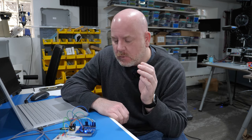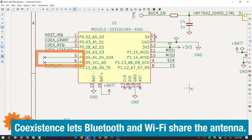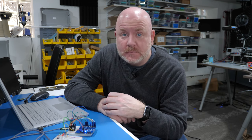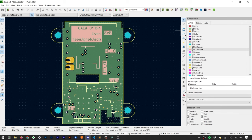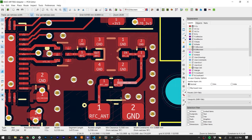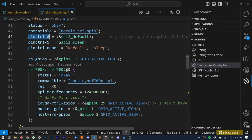Just to branch the timeline again — before all of this, I designed a custom PCB for the NRF7002. The schematic mostly followed the reference design from Nordic. I matched up the SPI and coexistence signals to the Xiao's available pins, left two analog pins free, and those two pins are I2C compatible so I can use them with an analog or digital light sensor. The circuit board is a four-layer board — signals on top and bottom, one inner layer is only ground, and the other has the voltage rails. I also did my best to design the RF traces to be 50 ohms.